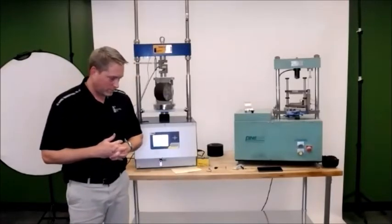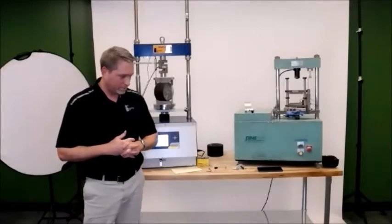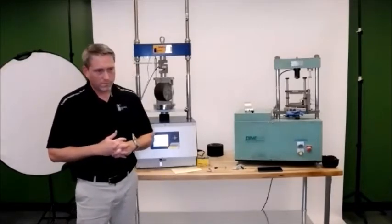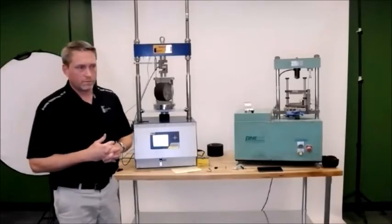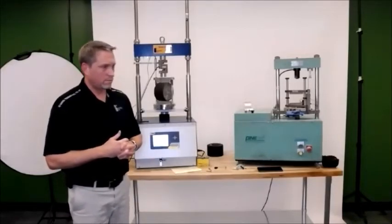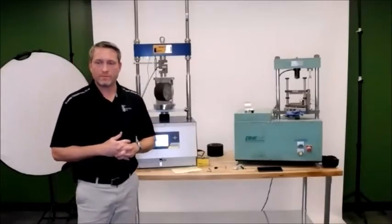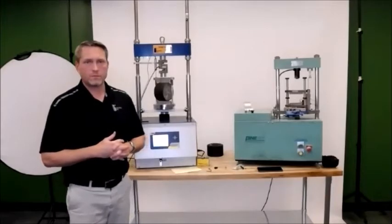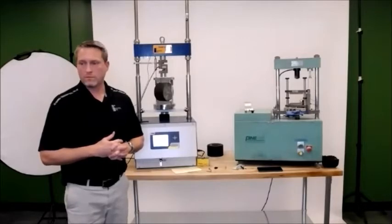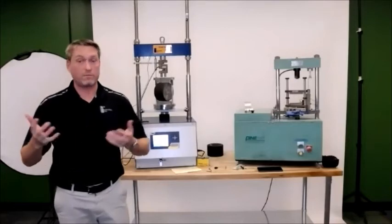Quick question that I've been wondering about: in the ASTM procedure, it talks about the target temperature that you're cracking the specimens at. It looks like there are 2 different options. There's a calculation using your PG temperatures, or they just state 25 degrees C. Are you seeing either or being performed nationally?